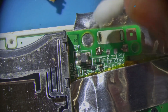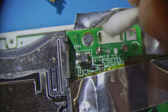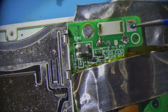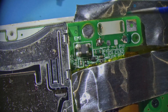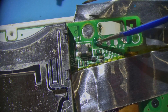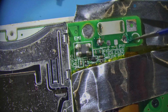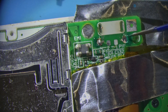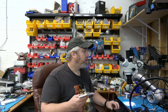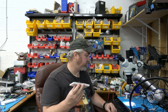I've been told not to use solder mask as glue, and I know it's not a glue, but I'm thinking it's going to help keep those pads in position. I'm going to put a little bit of mask on the edge there — I actually did more than I meant to. I like the way that first one went better; this one's too much. Okay, now I'm going to bake it under UV light. I have a high-powered UV light that'll allow me to cure it really quickly without additional heat.